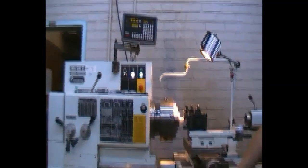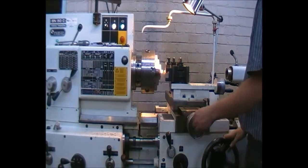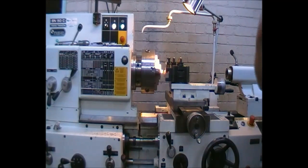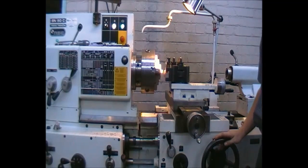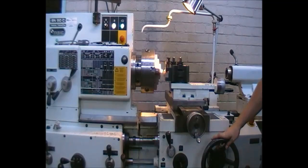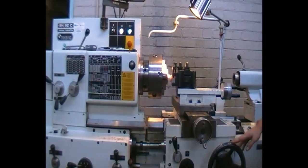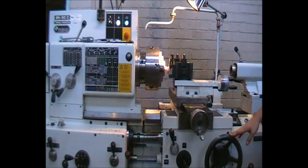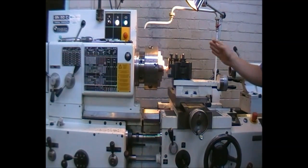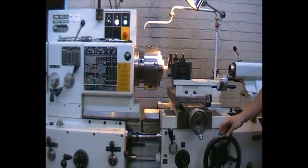Now we can move back safely as we have already referenced our part. Extract the X-axis to beyond the size of the part to be machined. In this instance, we are going to take a 0.2 mm cut, so on the digital readout this will be at negative 0.2 mm, whereafter we switch on the machine in the correct rotational direction and move forward by hand, not with automatic feeding. It is about surface speed.